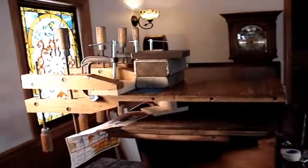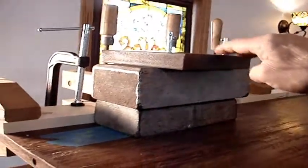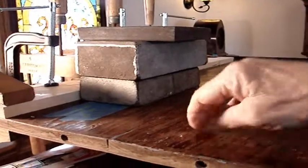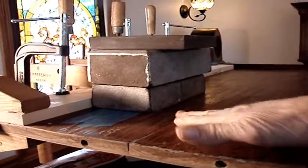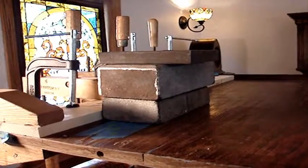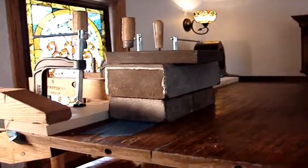I'm finishing up with the gluing of the left side. I've got the bottom edge glued down and the front edge glued down. Remember that big bubble in the middle? That's what these weights are for. The bubble had a crack — it was split — so I squirted as much glue as I could get underneath it, pressed it to squeeze out the excess, wiped it off, added a little more glue, then taped it over. Now I've got it weighted down.